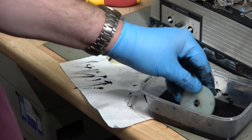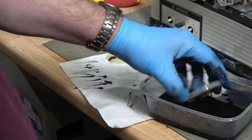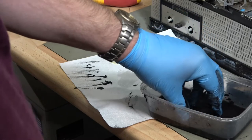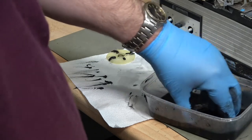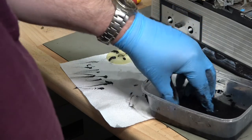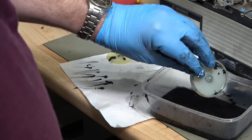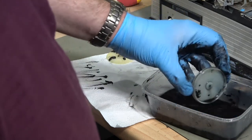I've switched the cleaning process. I was using paper kitchen towels with isopropyl alcohol, but this one was so bad I decided the only way was an alcohol bath — about 90% isopropyl alcohol. It is absolutely black in there, but it is finally removing the gunk off this wheel. A toothbrush and isopropyl alcohol — that's the method.